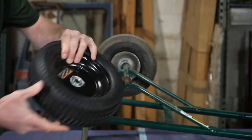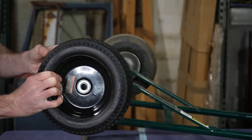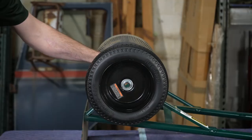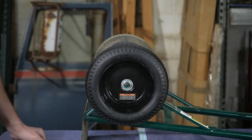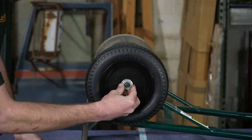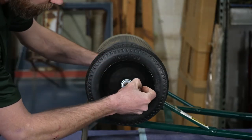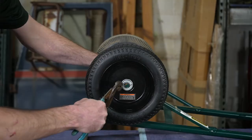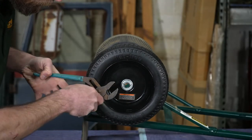You have a side that protrudes and a side that is indented. The indented side sticks out and the protruded side goes in towards the middle of the dolly. All you do is slide it right onto the axle — very simple. This particular dolly doesn't need much of anything. Out of all the accessories that come with the kit, all we're going to use is the washer. I've chosen the thicker washer based on the amount of axle still protruding. Then we reuse the cotter pin from earlier, slide it in, and taking our pliers, pinch and pull up the bottom of the cotter pin to secure it.